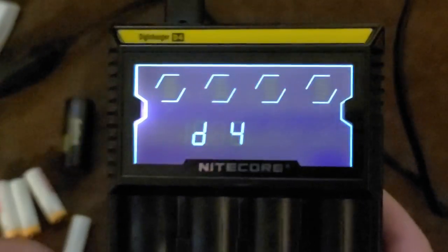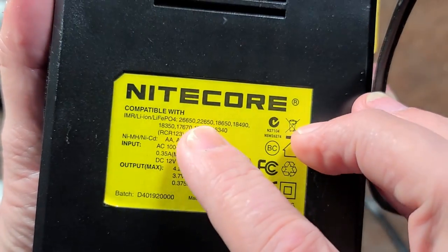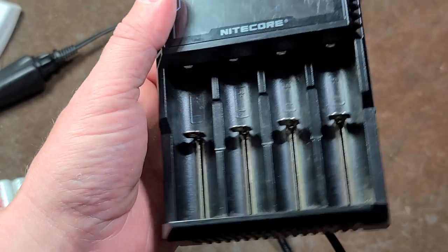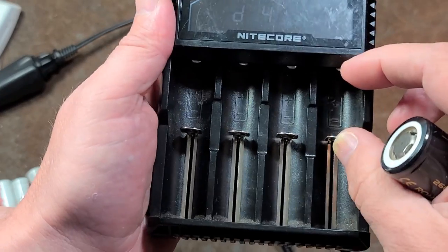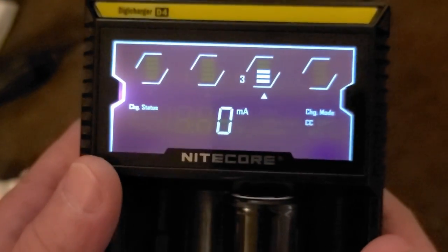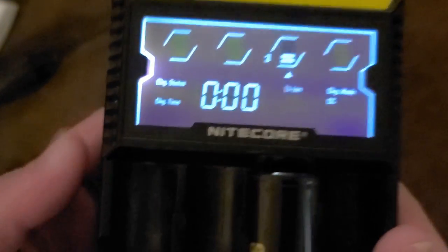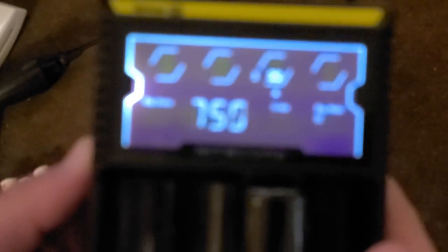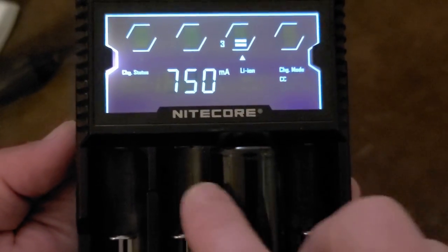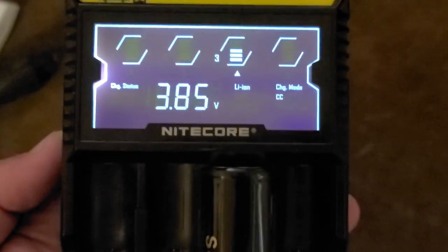Plug it in. They still sell this thing, and this one does work. It does accept these big 26650 lithium-ion batteries and it is certified for them, though it's not really designed for that. It's really more of a 4-bay 18650 or a variety of other lithium-ion cells. These get pretty darn close, so we'll work with one of these. It detects a higher voltage, and it has some modes where it displays the charge current. It's only 1.5 amps, so if you have two cells it'll do 750 milliamps per cell; if you have four, it'll only do 375.